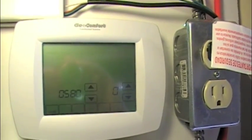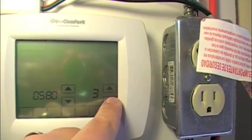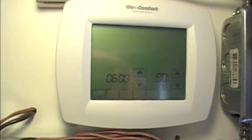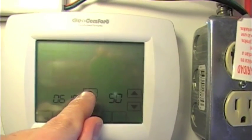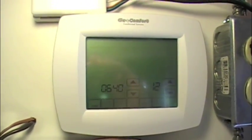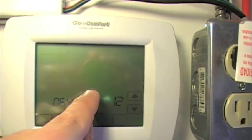Item 580 is compressor protection — anywhere between zero and five minutes; leave that on zero. Item 600 is high temp range stop at 90 degrees. Item 610 is low range at 50 degrees. Item 640 is clock format — 12 or 24 hour time; leave it on 12.